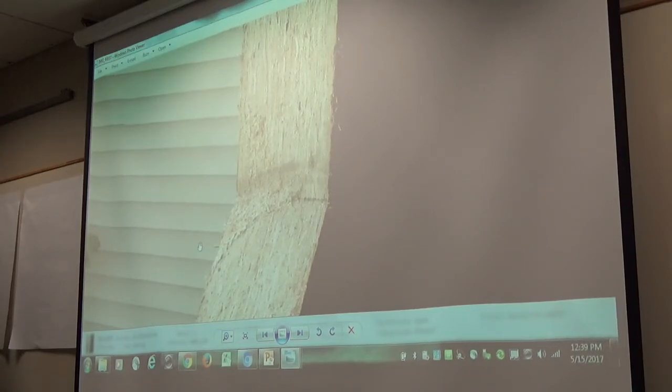a 2x4 across, screw it to either side of the wall, and then put a couple screws in the panel. Then you can cut the top, cut the bottom, right? And then your panel doesn't jump out on you. Then you pull the screws and take it out and set it to the inside. So when you're cutting, your inside dimension is all going to be your rough opening, and so your window then will pitch out, so the outside opening is a bit bigger because of the pitch.